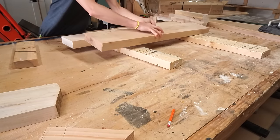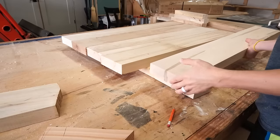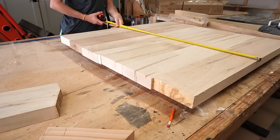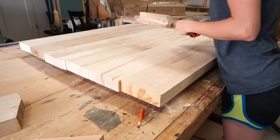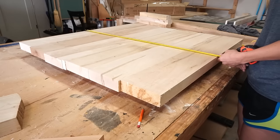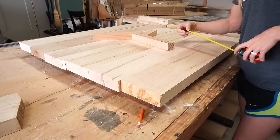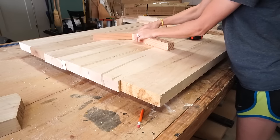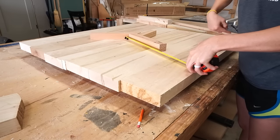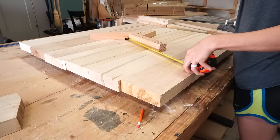I began this project by laying out my tabletop pieces. I thought it would be easier to just lay out the pieces and see what length seemed good for the braces for the size top I was building. My existing coffee table is 34 inches in diameter, so we're going to make this one 34 inches in diameter. I need to figure out how long to make the top pieces so they're going to fit together at about 30-degree angles. If the table is 34 inches in diameter, it's probably safe to make these about 15 inches.